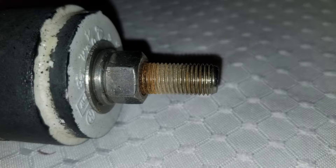This is the kind of thing to be aware of. If you've got antennas that have been out in the weather — mobile antennas, field antennas you're using for camping, Parks on the Air, field days — even some of your home shack antennas, you might want to show them some love every so often. Once a year, give them a good going over, see if anything needs to be repaired or replaced, and check for any corrosion building up, just to keep them in good working order.